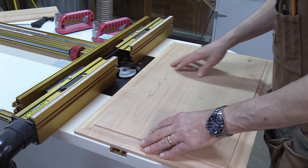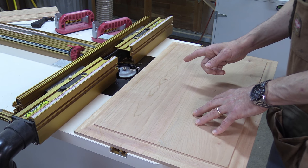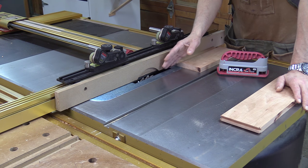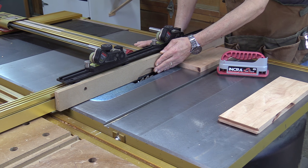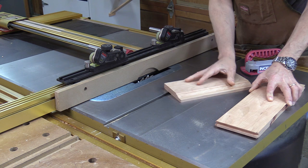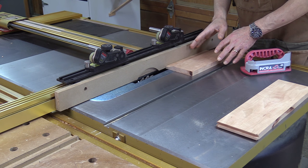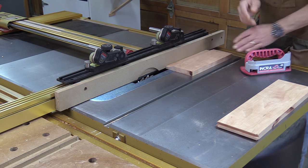The cleanup pass worked really well — I've got really nice smooth surfaces and this shouldn't require much sanding at all. I'm also going to run my test piece through, which is important for the next step. I've got my dado stack set up in my table saw with a sacrificial fence. I've got three-eighths of an inch width of the blade exposed and it's raised up maybe a little over three thirty-seconds. I'm trying to do a back cut so the panel will fit into that groove — I'm going to sneak up on it, it might take two or three passes. I'll make a test cut and see if it fits, then raise the blade very slowly until it fits perfectly in the groove of my test piece.